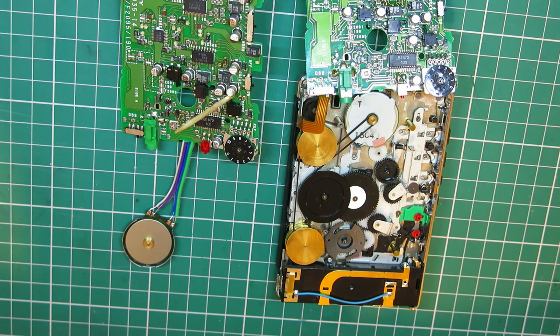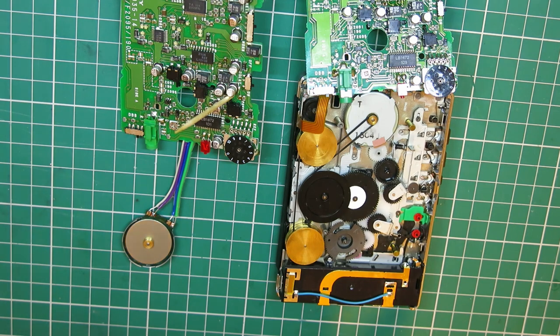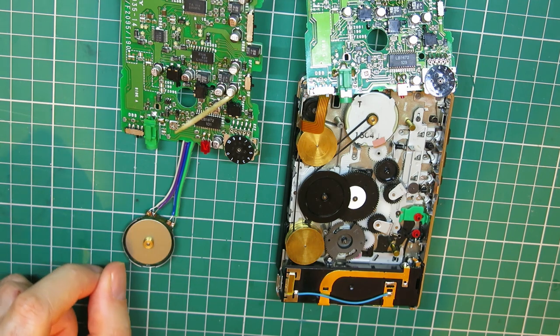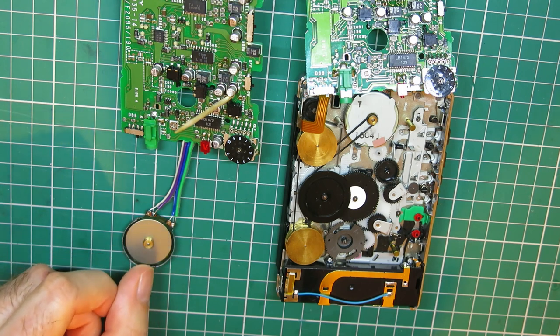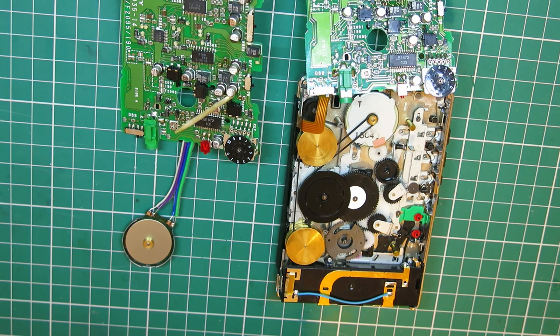So I decided just to try and sand it down, clean it up with alcohol, and then clean and lubricate the bearing. On the Stereo To Go forum, it's recommended that you use a little bit of fine oil for the actual centre of the bearing and a tiny bit of grease on the top of the bearing, so I did. And I soldered some temporary wires to a spare board, and I ended up gluing the coil board back in with just some tiny dots of epoxy resin, araldite basically, just around the edges as the original one was done, just leaving enough clearance for the top disc to go back on. Reassembled it, and I've got a power supply hooked up to it.